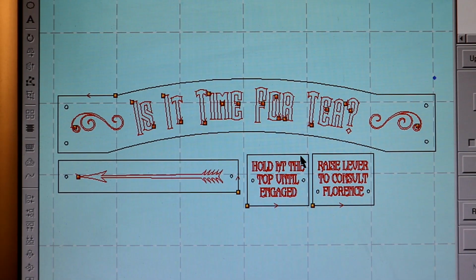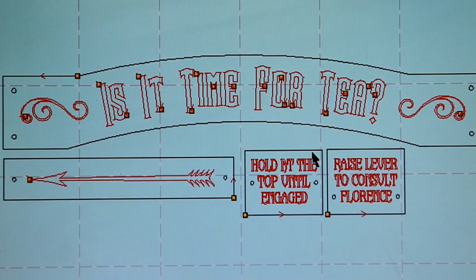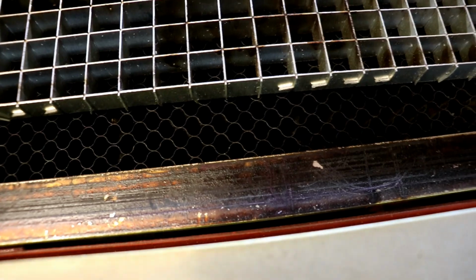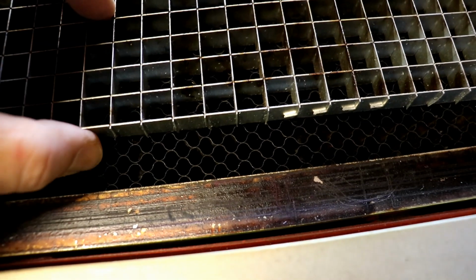Brilliant. This is definitely the biggest sign I've ever engraved. It's huge. I thought I'd do it all properly with the raster engraving to get really good quality. So let's get it on the machine and get it going. This engraving laminate is a layer of black plastic at the back, about 1.5mm thick, with a very thin layer of white plastic on the front. So once the laser starts cutting away at it, taking a titchy, really shallow cut, you see the black coming through from underneath.